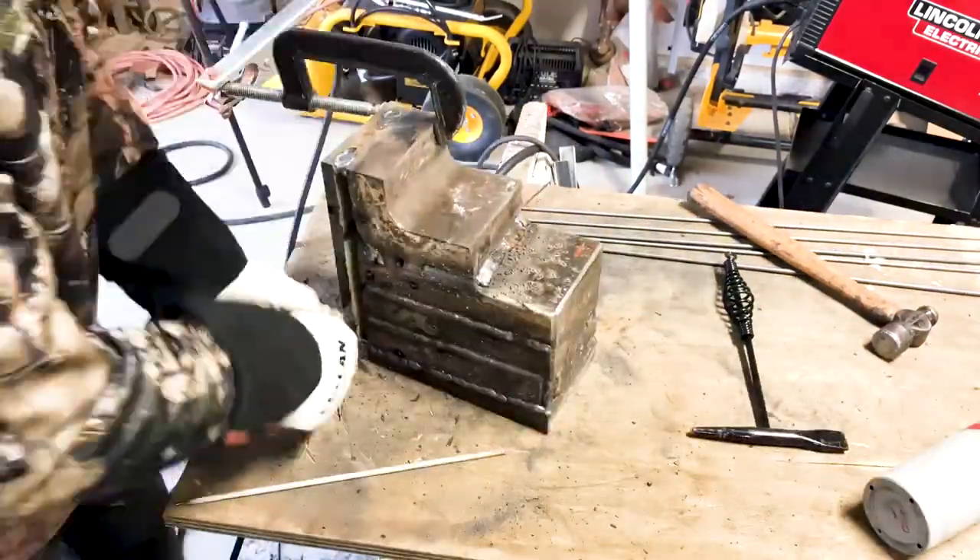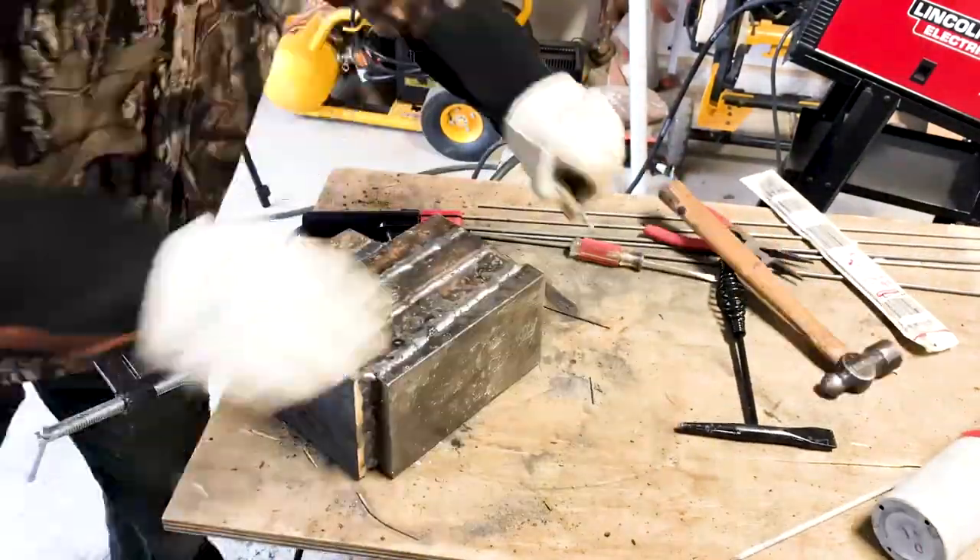On an anvil project, I had quite a bit of weld to lay down — welding a gap, filling it in, and bringing that gap out to the surface. It was pretty deep and required a lot of welding. We were running 7018 eighth-inch rods, which was just too much for this little welder. When cool, I could burn all the way through one rod maxed at 240 volts getting 165 amps. But once heated up, it wouldn't run more than an inch of weld. Most people buying this aren't looking for a stick powerhouse, but for small TIG projects, it's great.